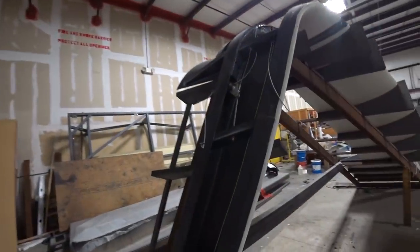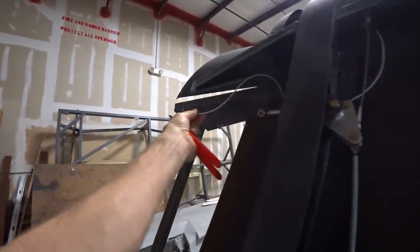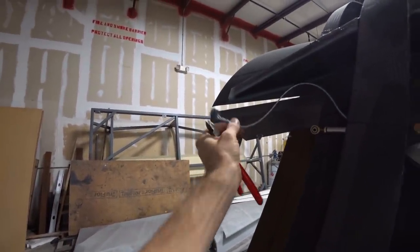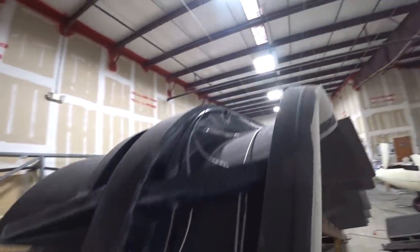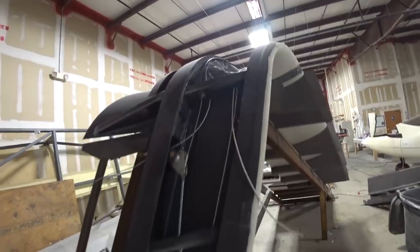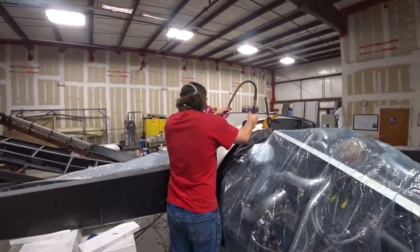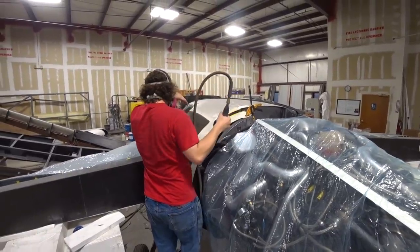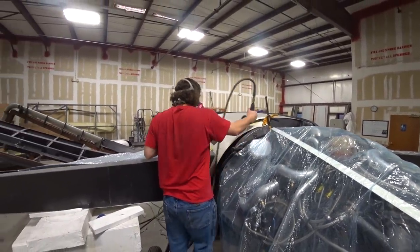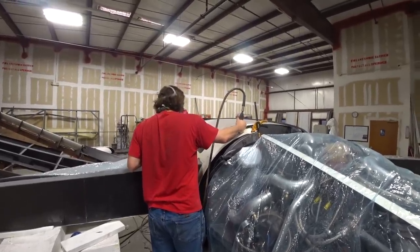Back on the wings, another telemetry item is an accelerometer in the rudder to pick up any flutter — in and out motion — wiring back to the main harness and data capture unit. Devon is also cutting a notch in the fuselage skin at the engine compartment to allow the parachute strap a place to deploy, and that will be covered with a breakaway cover later.